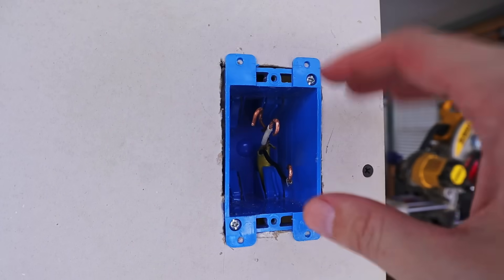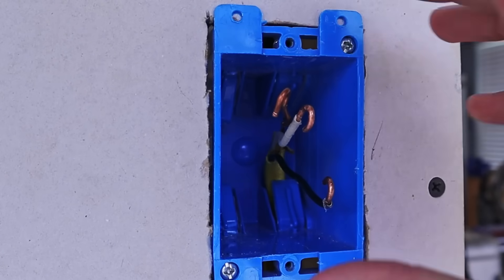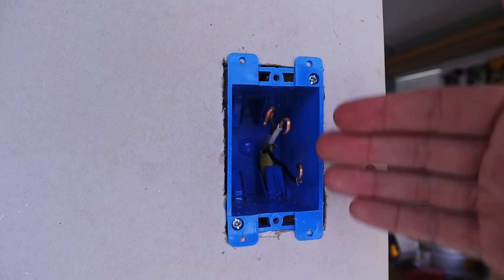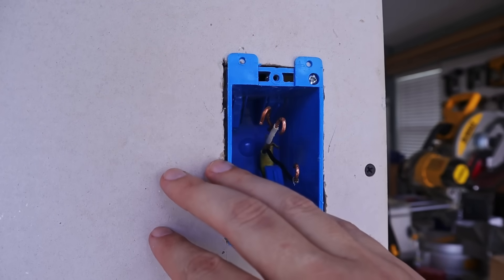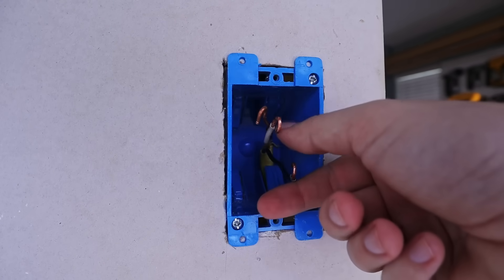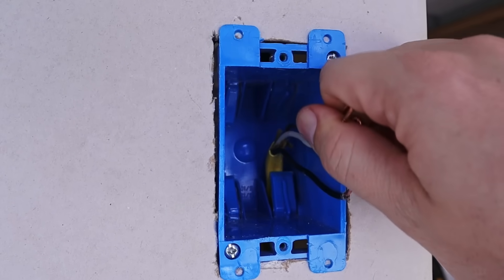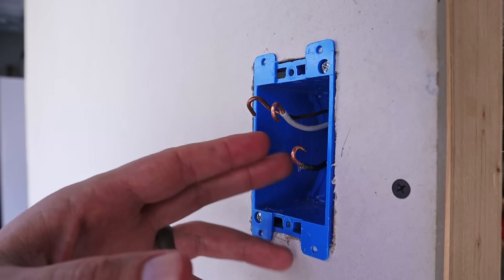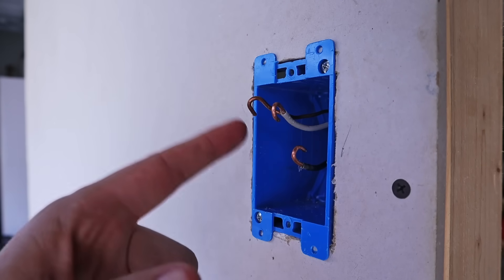The first thing to try is to see if there's any slack in the wiring. Most of the time when wiring is installed it is stapled such that there won't be any slack. However, in some areas they will have a service loop — a loop of wiring behind the wall that you can pull from to extend the wires in the box. Give it a little tug and see if you can get a bit more. Since I was not able to pull much extra wiring out, I'm still not code compliant, so I'm going to have to extend these wires.